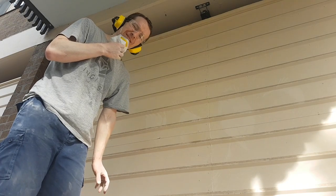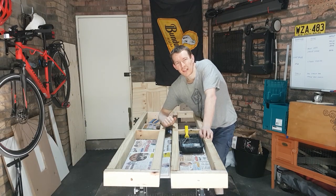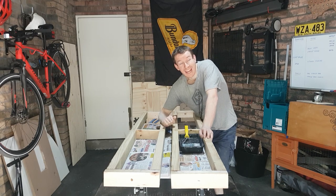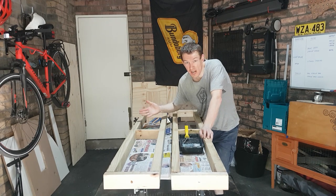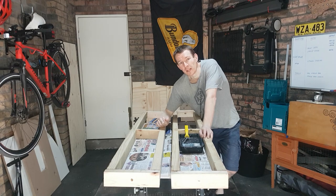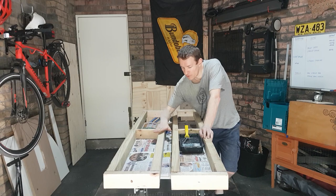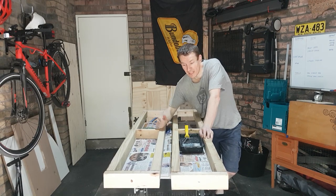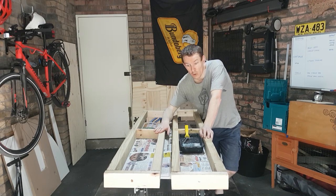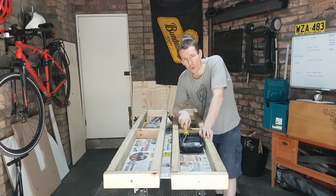I might start painting for a little while - that'll be relaxing. I'm six and a half out of eight holes down. Honestly I'm beginning to think that eight 10 mil dyna bolts is well, well overkill. If I'd gone for either just one dyna bolt on each side, or even thinner dyna bolts, I would be having a much much better day. It is tough work drilling 50-year-old concrete. I'll get that done next, but right now I'm buggered. I'm going to paint these - whack a bit of sealant on and get some undercoat on for a nice relaxing end to a noisy dusty hot day.